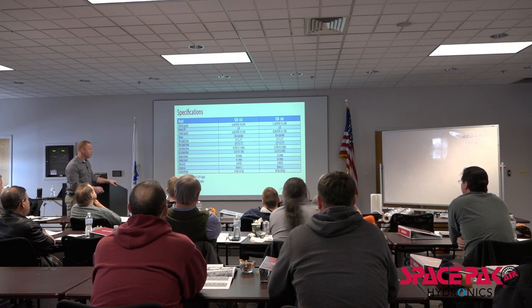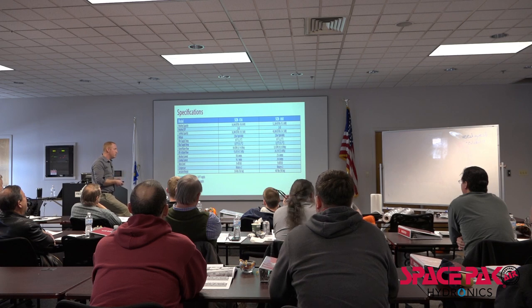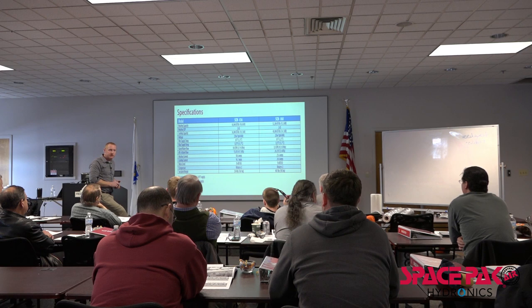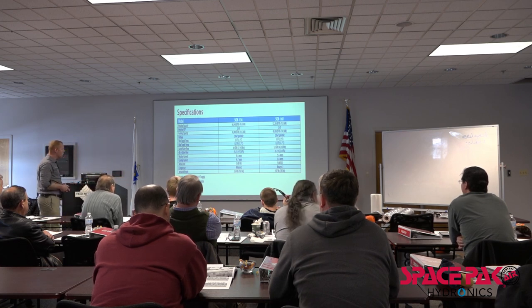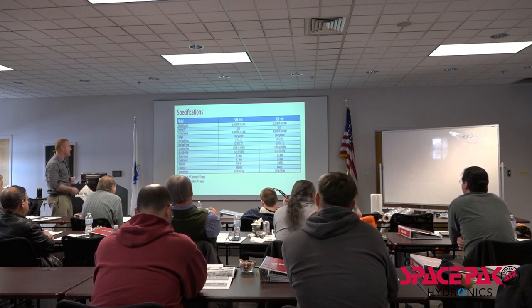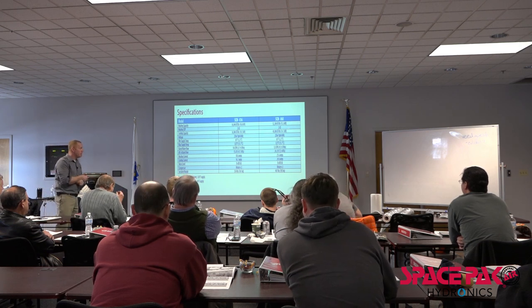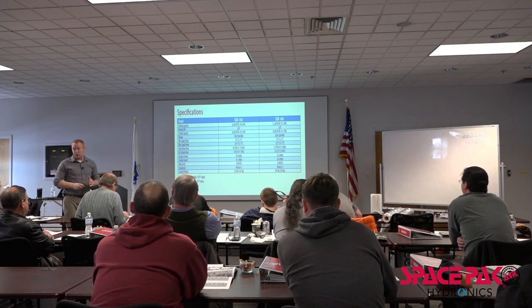And we come down, we look, flow is everything, right? We're gonna talk about flow like 400 times this afternoon. GPM, we need between 10 and 12 GPM flow through those heat exchangers, okay? And look at our amp draw, we're in the 25 to 30 amp range. Two rotary compressors. Our cooling data is delivering 44 degree water at a 95 degree outside ambient. Now look at our COP, right? Our heating COP is up over 2.65 when it's 47 degrees out, which means you're getting a pretty darn good return on your money.